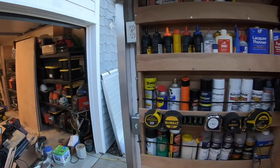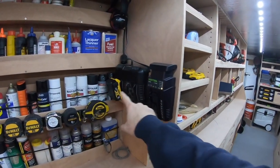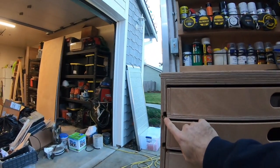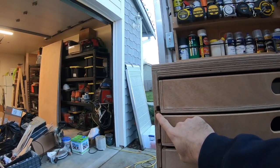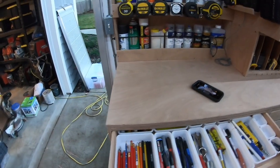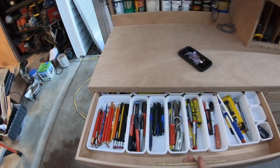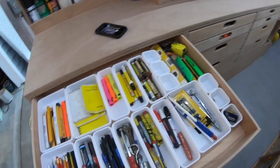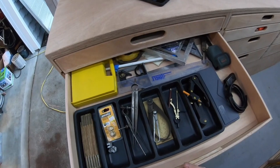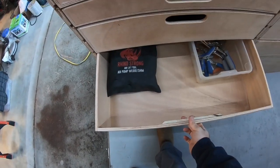I made this from part of an old framing square that I knew wasn't square anymore — I reused it and cut it off. We have chargers — these are all wired in up above. All the drawers utilize just a little tiny 3/16-inch tall piece of hard oak, and that's what retains them. The drawers have a notch — to open them you lift and pull, and right here there's this little notch that the piece of oak catches on, and that's what keeps them all in while going down the road. This is all marking tools and layout tools.